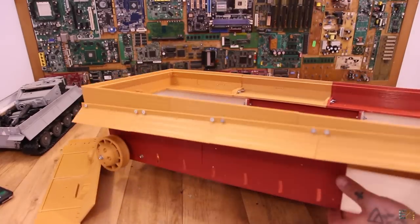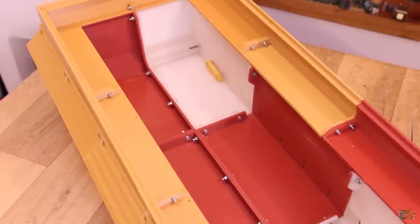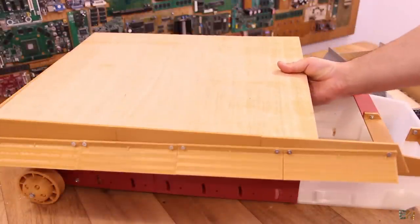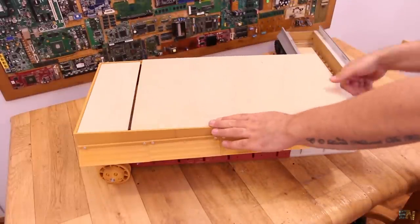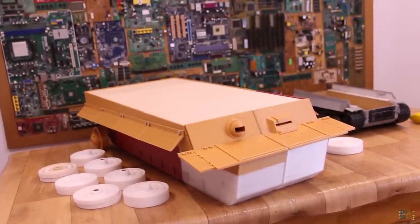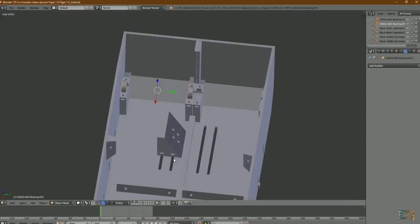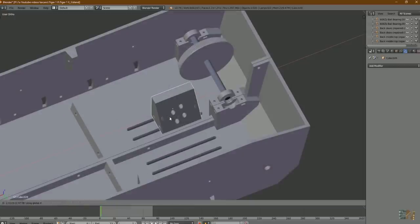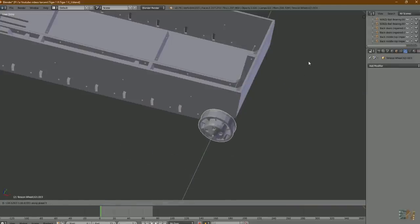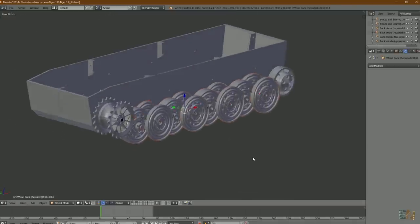This is all I have for this video, but now I can design the rest. On top of the tank we need a huge plain board. We could print that but it would be very ugly because I'd need to divide it into 6 parts, so instead I'm planning to use balsa wood and add the rest of the details later with 3D printed parts. Let's take a look at the design in Blender. On the front part of the tank we'll have the gear wheel connected to a smooth rod with bearings, then the gear with the belt connected to the brushless motor. On the other side we'll have the tension wheel on the back of the tank fixed with a screw to pull back the tracks and add tension. Between these two wheels we'll have other wheels on each side to support the tracks — four thick ones and eight thinner ones.